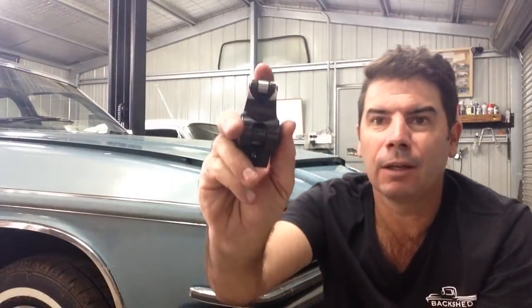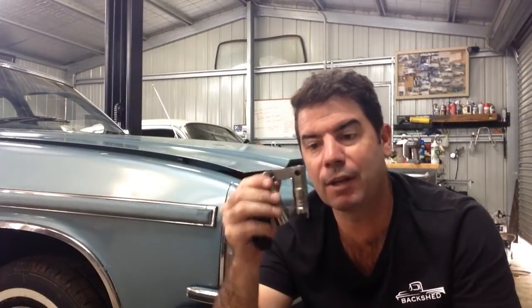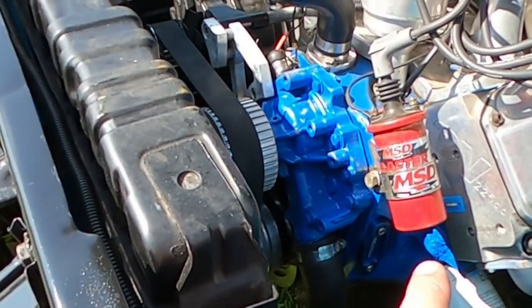Probably useful information: the one thing I'll take away from it is, next time you're putting something together like that, just have a look at the rocker angle. Make sure the roller tip is sitting in the middle of the valve — not off to one side — because that was a very, very expensive motor, and unfortunately it was let down by a simple mistake. It actually got worse from there: when this had broken and tried to move sideways, it actually cracked the lifter bore of the Cleveland block and destroyed the whole block. So from that original motor we got the cylinder heads and manifold — hence why I didn't put a dual plane on it — the stroker kit and rods, and that was about it. That motor's basically been built from scratch in the bottom end and it's a 408 stroker.